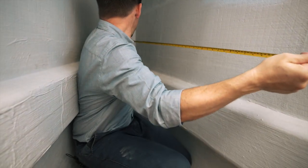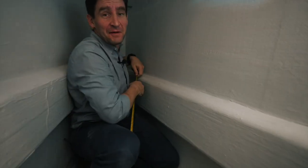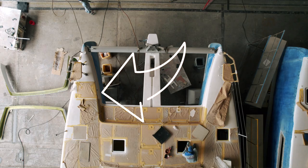We've got 2.1 metres on the length. This is going to be a wet locker - being at the front of the boat it's perfect for sails, keeping it nice and lightweight. You don't want heavy equipment up the front. So: fenders, mooring lines, sails. It's a wet locker, so we need to have the sails elevated - some sort of grate - because this will be a draining locker. It's important we don't have water sloshing around the base. Versatile space, a flow-coat finish - you can throw anything in here, but keep the weight down forward.